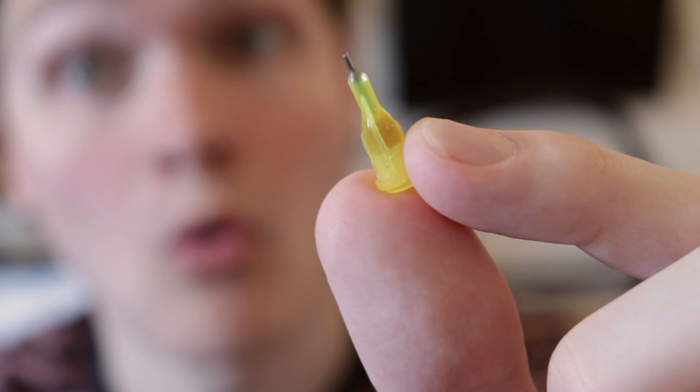It kind of did it — it looks like trash but it made a circle and the little crosshair. From here on out it's just tuning to get the right amount of paste to come out and figuring out retraction settings between movements and all that finicky stuff. Also I'm just using the raw blunt end of the syringe which is like a millimeter and a half in diameter — that is just not going to give me a lot of good resolution. Now that the whole g-code pipeline is working, I'm going to put my really tiny little nozzle on the end and scale everything back to extrude much less, and hopefully get a much more precise little spot of paste. For this I'm just going to do dots — that's mostly what this paste extruder is going to be doing, just putting a little dot of paste on tiny little pads.